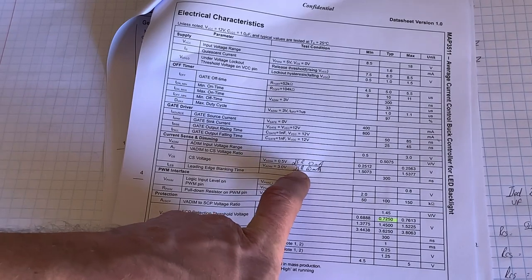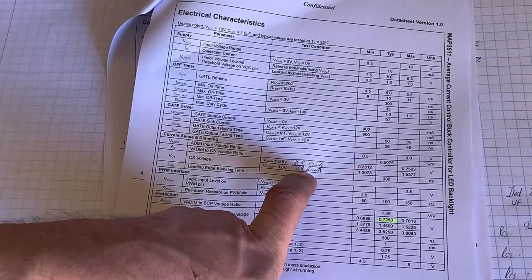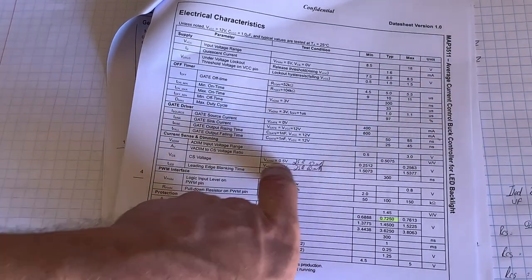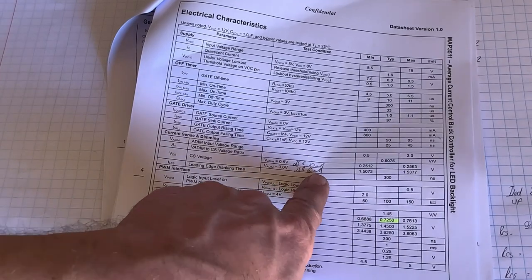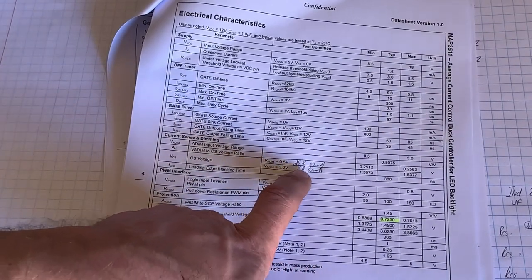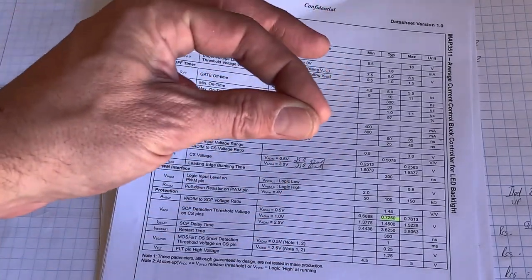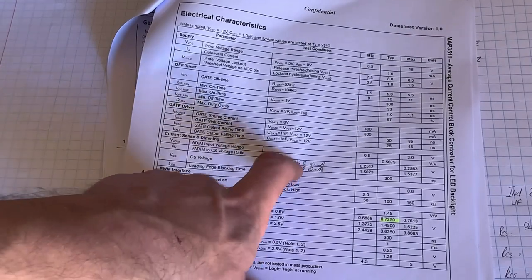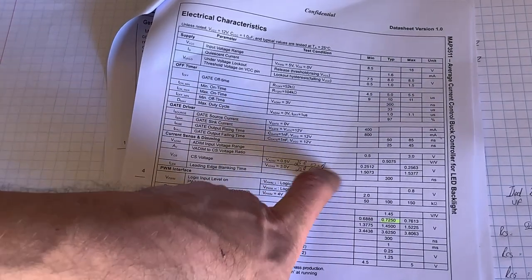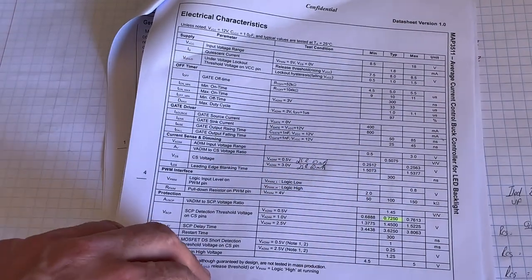25 ohm. What I've done is a little bit of a calculation before I actually saw the formulas. 25 ohm for 60 milliamps at 3 volts will be perfect, will give us that 1.5 volt drop. Funny enough, at the 0.5, where the dimming circuit, if you were using the voltage dimming, that 25 ohm for 10 milliamps will give us that volt drop.